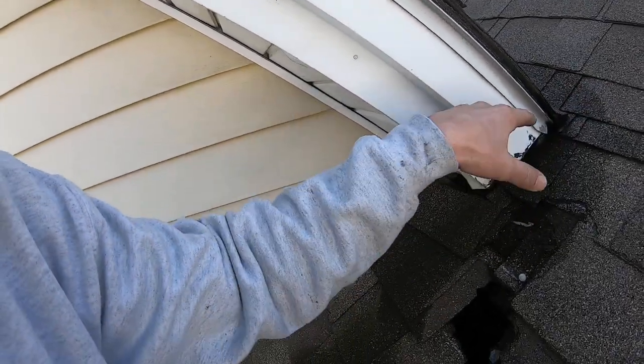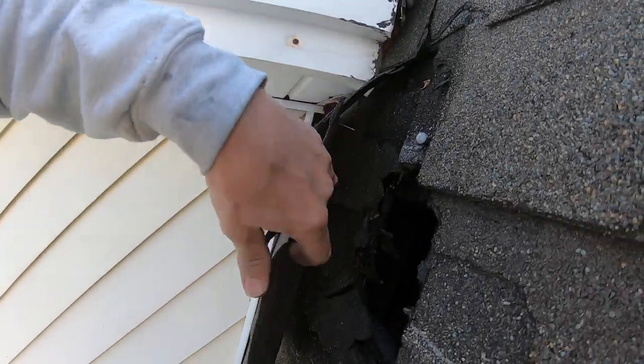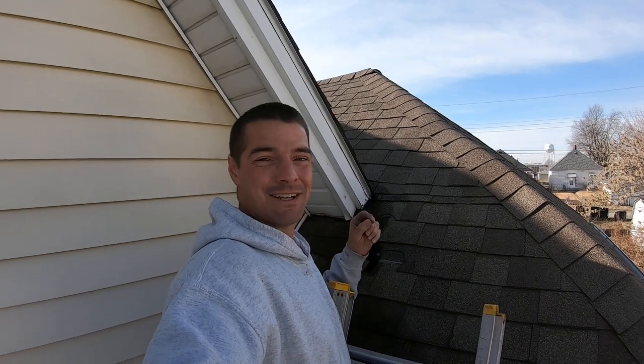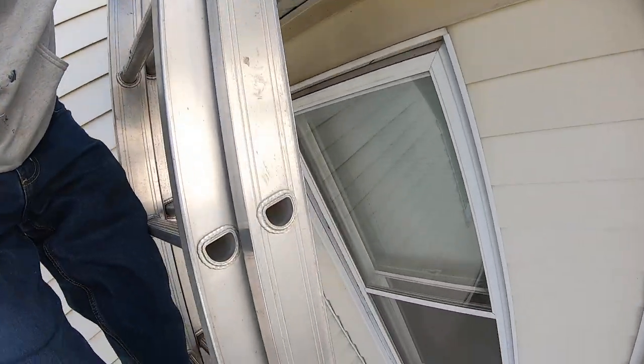Because what's going to happen is if you just simply roof over and butt into corners — or maybe you rely on caulking — you're going to have water pouring down into areas like this, getting in under your new layer of shingles, right in between your new layer and your old layer, getting into the nails. And you'll have a situation where there's now a Niagara Falls waterfall coming in right here.